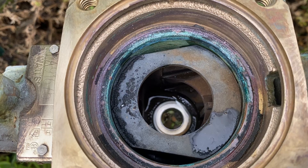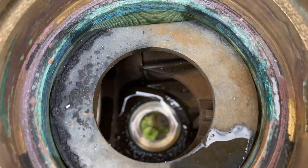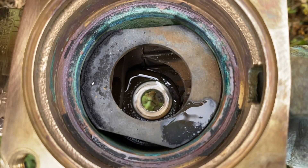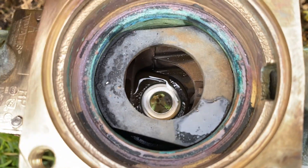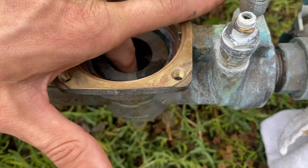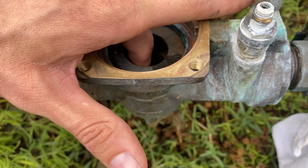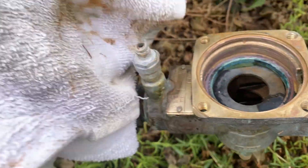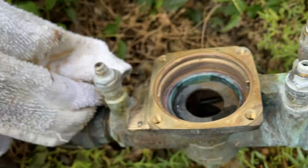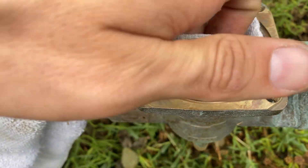Next is the spring. This is the metal seat for the relief valve disc to seal on — you want to make sure that's super clean. Typically you can feel with your finger if there's any nicks or grooves in it, or just take a rag and wipe it away, and make sure it's clear of debris and anything else.